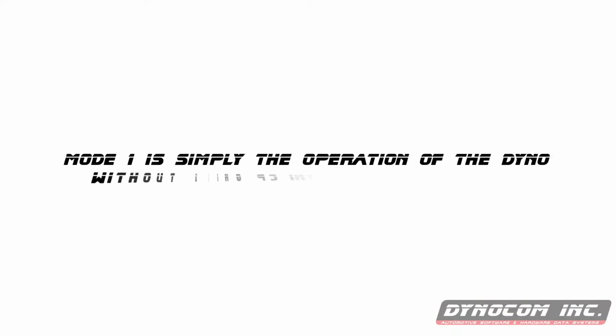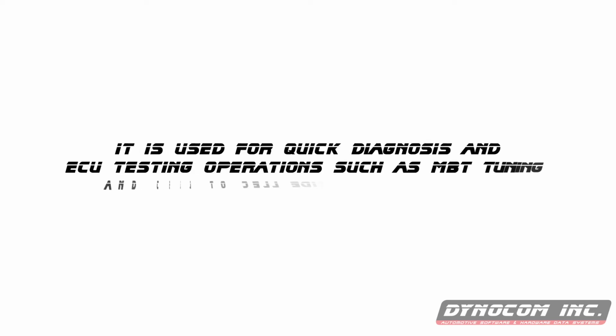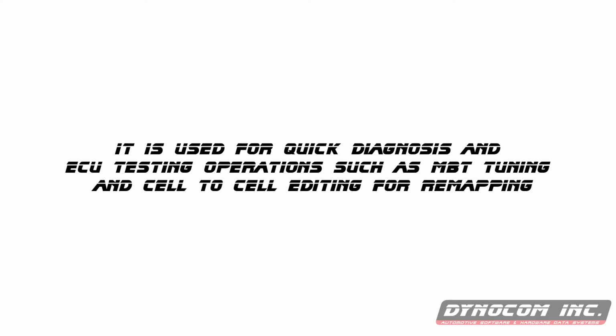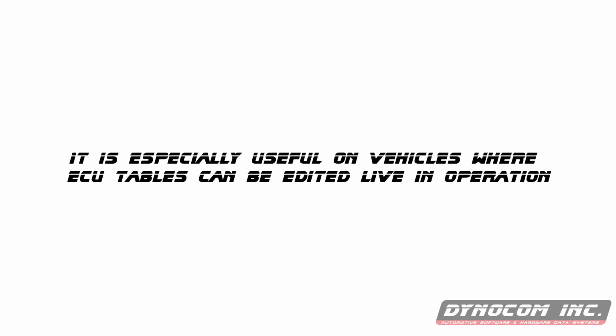Mode 1 is simply the operation of the dyno without using the PC interface for control. It is used for quick diagnosis and ECU testing operations such as MBT tuning and cell-to-cell editing for remapping. It is especially useful on vehicles where ECU tables can be edited live in operation.